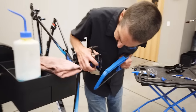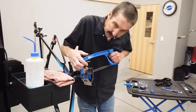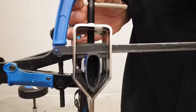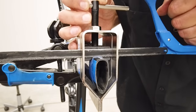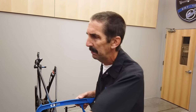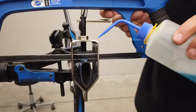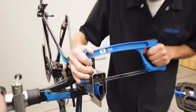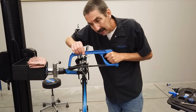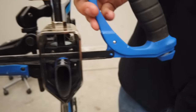Now all clear — fire in the hole. Let's watch this blade and see if we can see any of the material cut. I can also smell it — important tip here: soapy water. It's going to make the water wetter and it's going to cling to the surface. This really isn't to lubricate the blade — the blade's doing fine. Those bubbles and that water are simply going to keep down the particulate matter. We can see the mushy paste in there — that's the stuff that would otherwise go out into the air and into our lungs. We're going to keep that down.